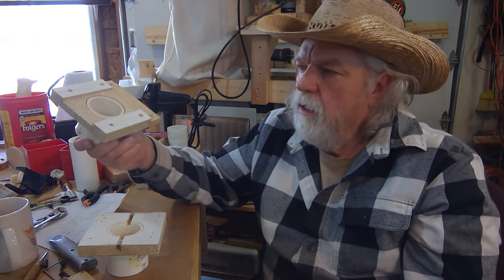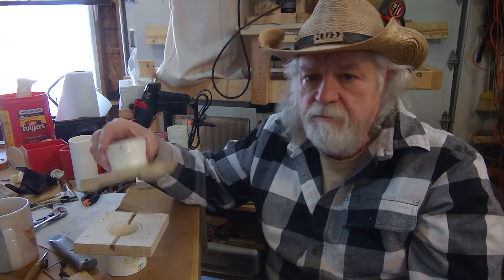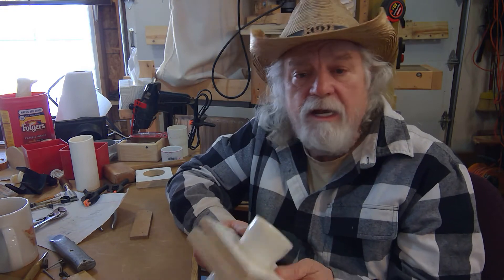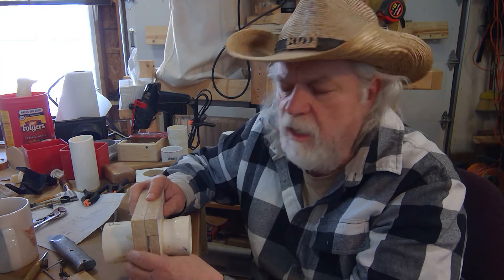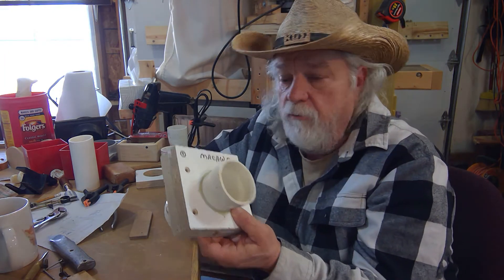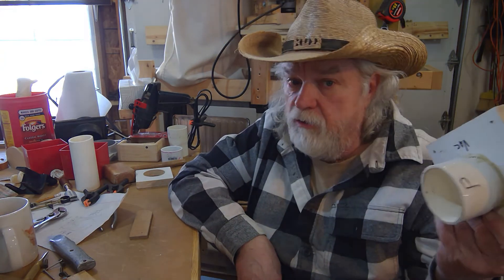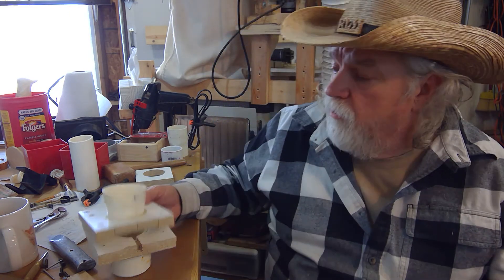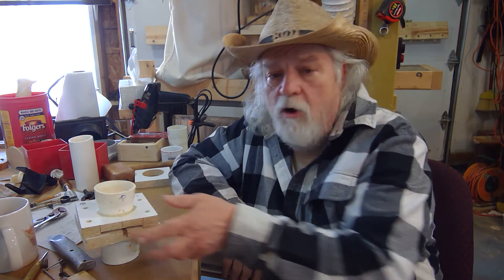It's real easy to make — just plywood, hardboard, PVC pipe, and hot glue. It doesn't take long. After I figured out how I wanted to make it and got the sizes proportional, I can make one of these in about half an hour. If you have any questions about how it's designed, how it's made, or how the clean-out works — or if you have suggestions — just leave them in the comments below. You can scale this up to a four-inch gate and still do the clean-out, so this whole idea works on any blast gate when you design it this way. For what it's worth, I think it works real well — this is my OTB blast gate. I hope you liked this video. If you did, please say so. Thanks for stopping by, don't forget to subscribe if you haven't already, and please come back again because we're nowhere near done. Thanks, and we'll see you again very soon.